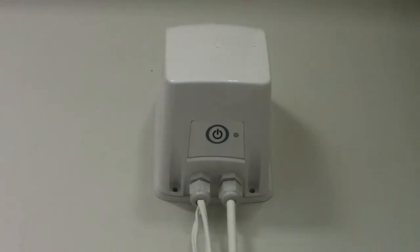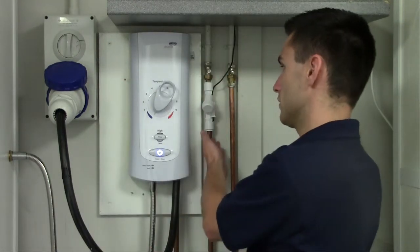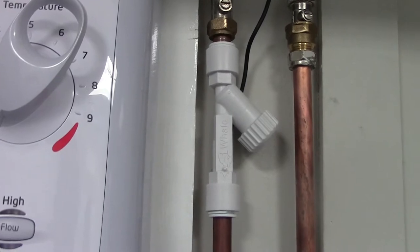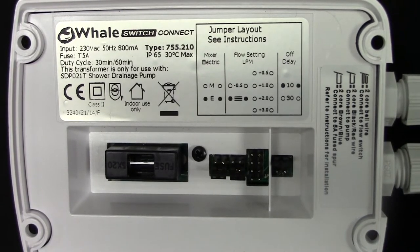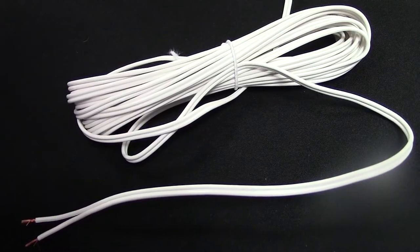This video refers to the SwitchConnect transformer, part numbers 755.120, 755.199 and 755.210, which are typically controlled by a flow switch on the pipework going to the shower. You can see what transformer you have by looking at the label on the underside of the transformer. The switch transformer can also be identified by the two core bell wire.